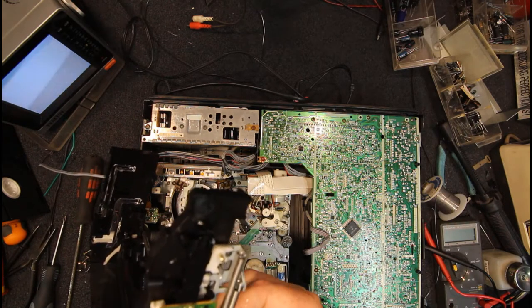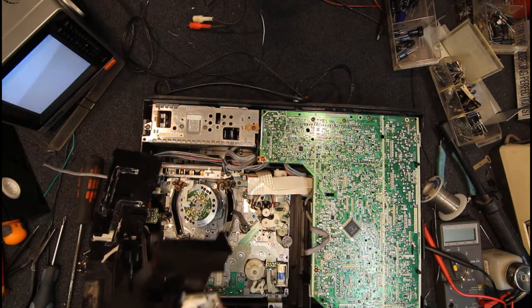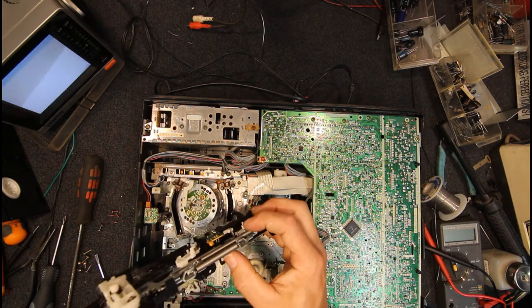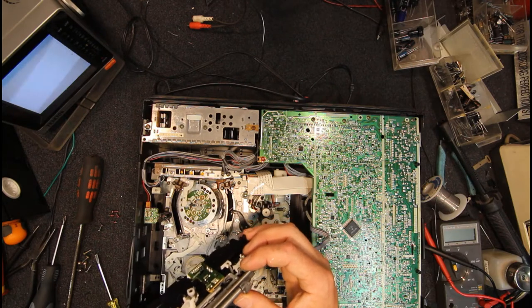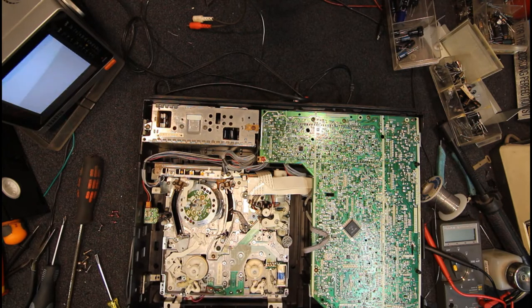I think this manages to pop outwards. And then it comes out of alignment with this gear on the base of the machine. I think that's what was the problem. I think the amount of tension on it, because that's where our tooth piece is on this metal bit, I think that actually bends outwards a bit. And that allows this gear to slip past it. So there you go, this one does actually have that problem.